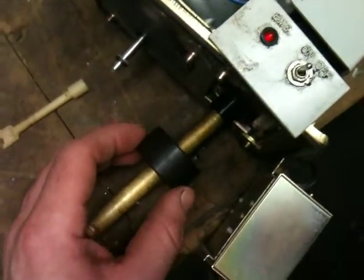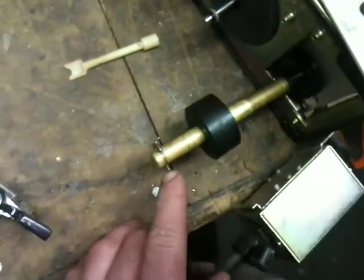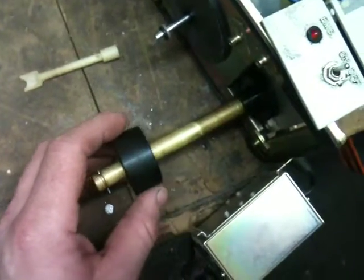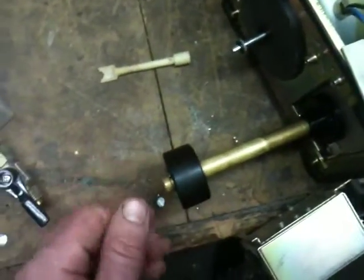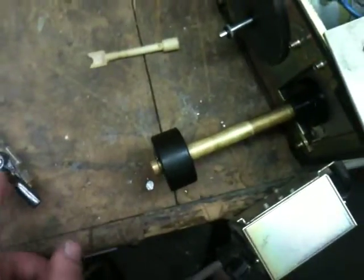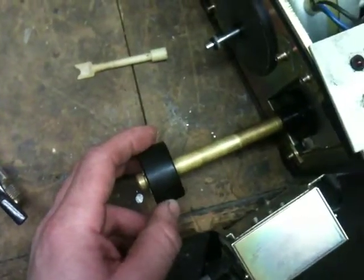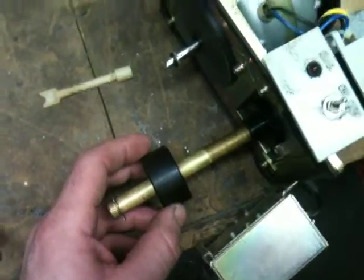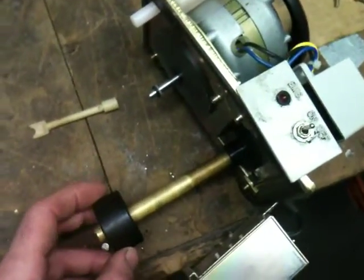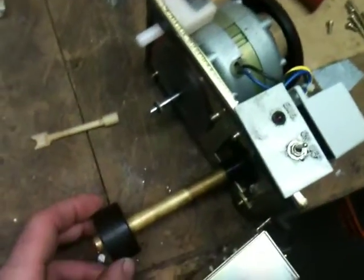My thinking is that this is a pretty clever setup. If the bowl drains out, it stops running — let me just reset that and turn it back on. It stops running because the machine probably presumes that you have a leak on the outlet line if you're sucking down and draining out the bowl that fast. You come up into this range, it's running and pumping. If there's a leak, it's going to shut the motor down so it doesn't continue to pump.